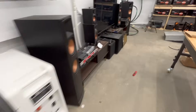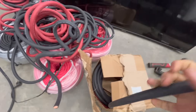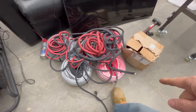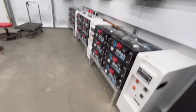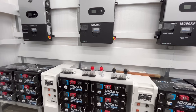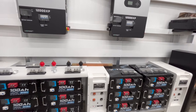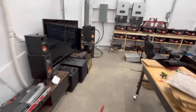I have all my cable in, so everything that I need is right down here. You can see there's the 4/0 stuff — this is massive. But all the cable that I need is here. And then for my solar panels, I've got eight-gauge wire and that's going to be wiring up all my solar panels. What I am waiting on right now — I have most of the lugs that I need, but I'm waiting on my 4/0 lugs to come in. And then I was short some 2/0 lugs that I needed as well. Once I get the 4/0 lugs in, then I'll be able to start putting together the rest of these cables, and the same for this system over here.